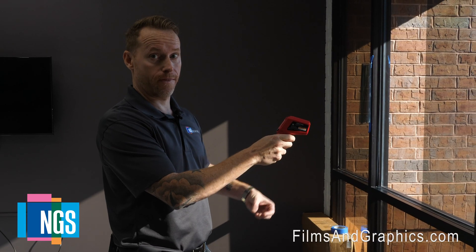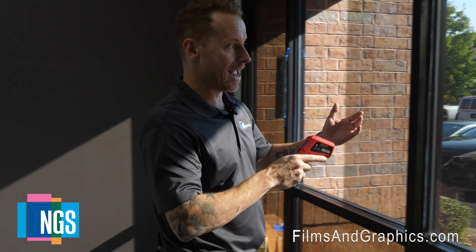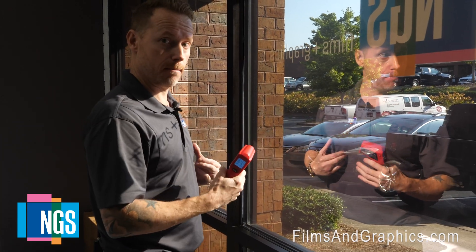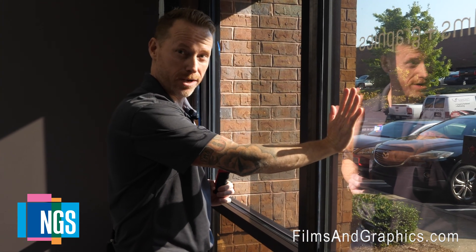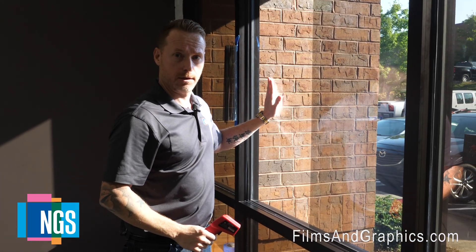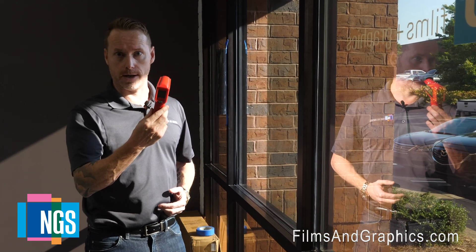So that's the absorption rate. When that solar energy gets absorbed in that film, it re-radiates back into the space. That's why when you stand this close to this film, you feel heat still because it's re-radiating back at you. When you stand over here, this feels cool and the pane is cool to the touch. This is actually hot — 110 degrees, basically enough to cook an egg, versus the pane that's untinted. So again, another reason why the physics of exterior film works so much better than an interior applied film, and this is a tool to demonstrate that.